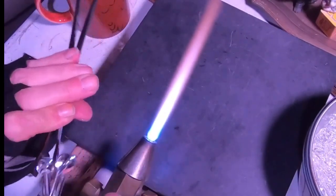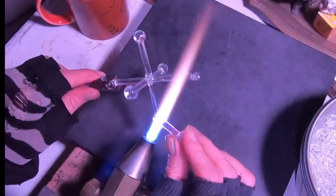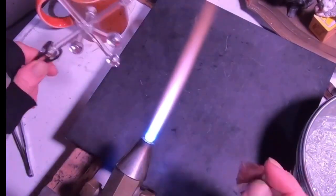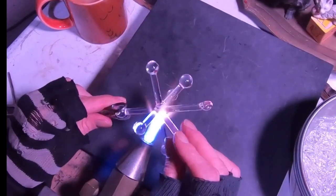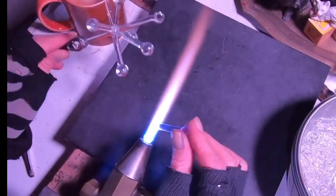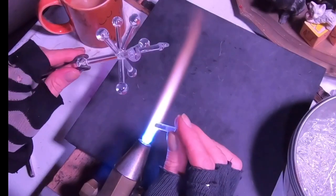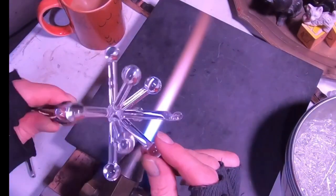The pieces are put on as hot as I can get them. The first four go on at a 90-degree angle to the hook rod. For the next four ball pieces, I heat a little triangle — the piece first, then that small triangle the three rods are making — and stick that piece on at a 45-degree angle from the ones I just put on. It needs to be really precise because if you're off or the rods are different sizes the look changes, but it can still look really cool.